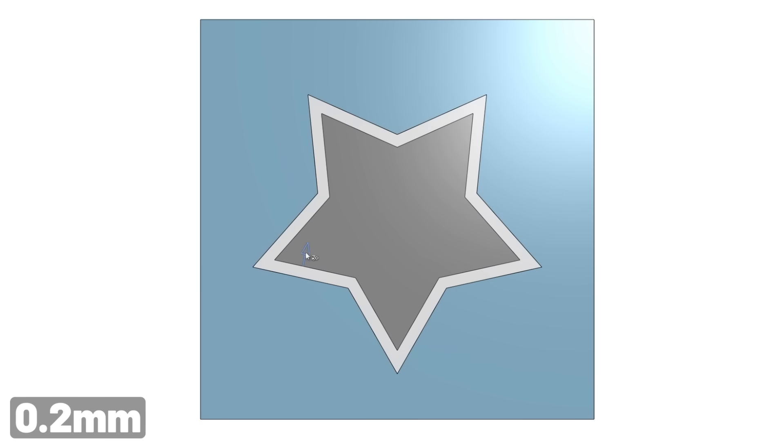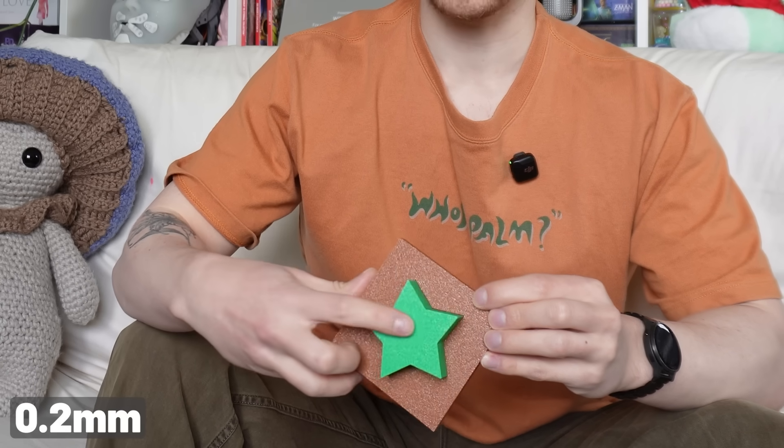So what's the simple solution? Leave a gap of 0.2mm between every interacting face. I default to this number all the time — it's a great starting point. That's the simple answer that will save you tons of spools of filament.